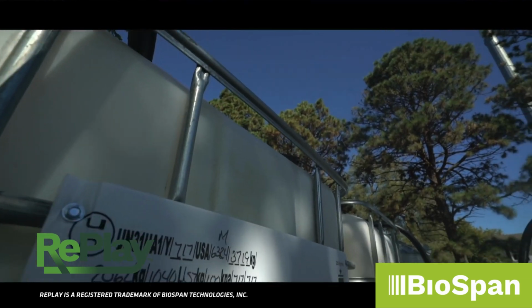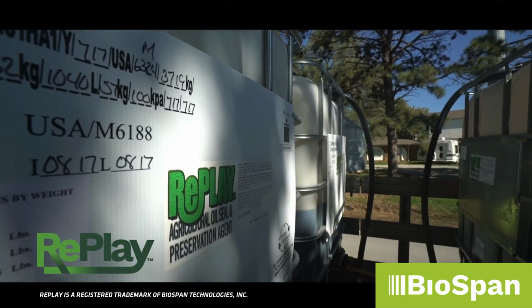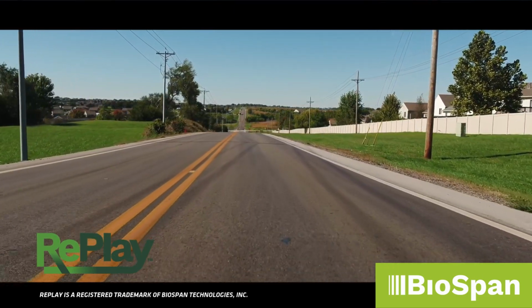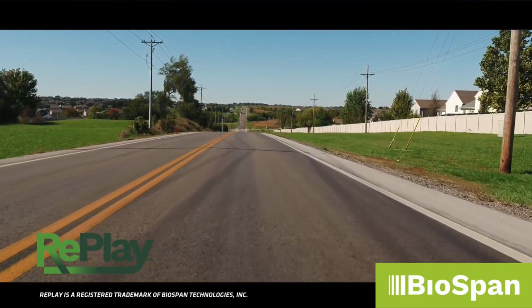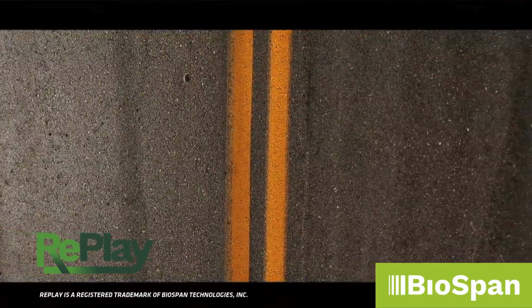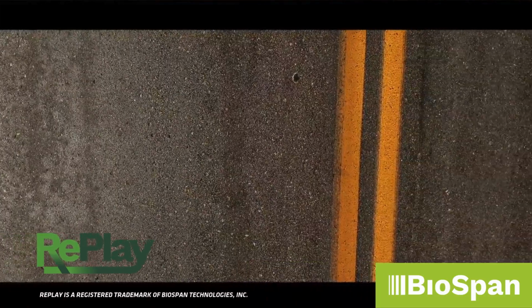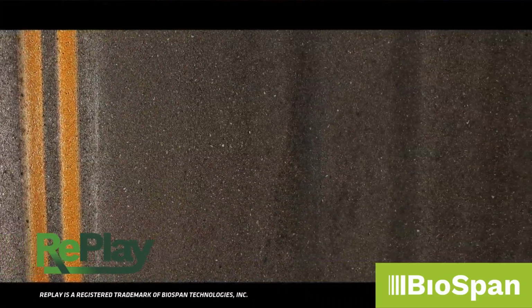They found that the RePlay-treated binders showed less oxidative aging compared to the untreated ones, meaning they retained their desirable properties for longer. So RePlay is not only making the asphalt stronger and more resilient, it's also slowing down the aging process at a molecular level. That's what the evidence suggests. Fascinating.